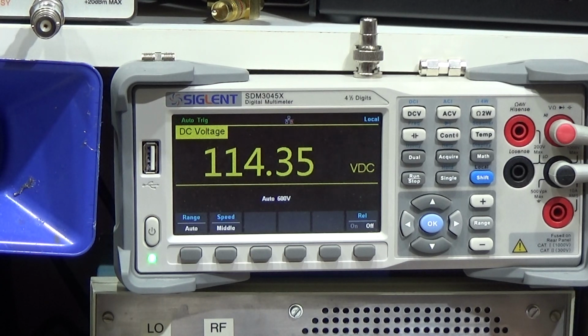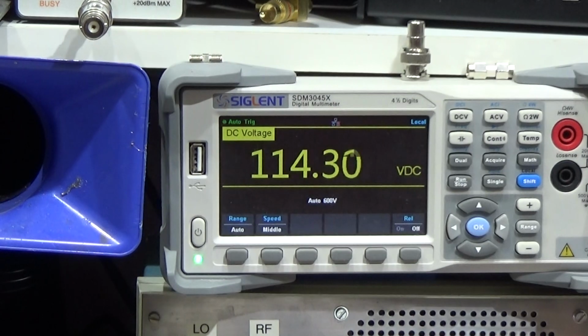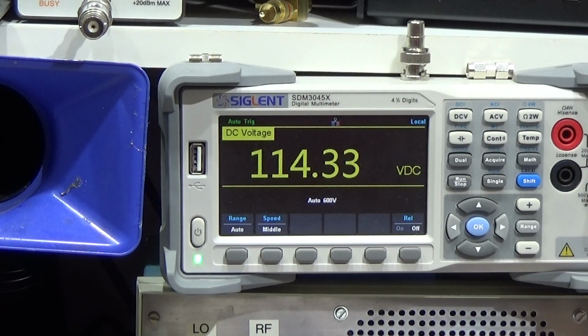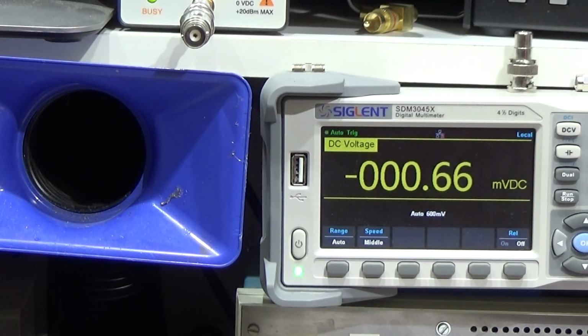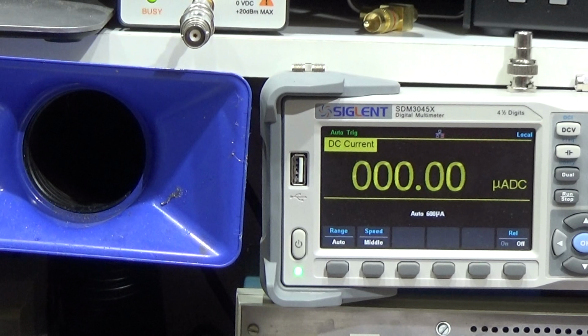But let's see what happens if I set it in transmit. When I pull it to ground, as we have seen on my little drawing, the relay here in the PA will be connected or set to ground. So let's see what that means. Therefore, I pull my plus wire and I set my meter to DC amps, okay?